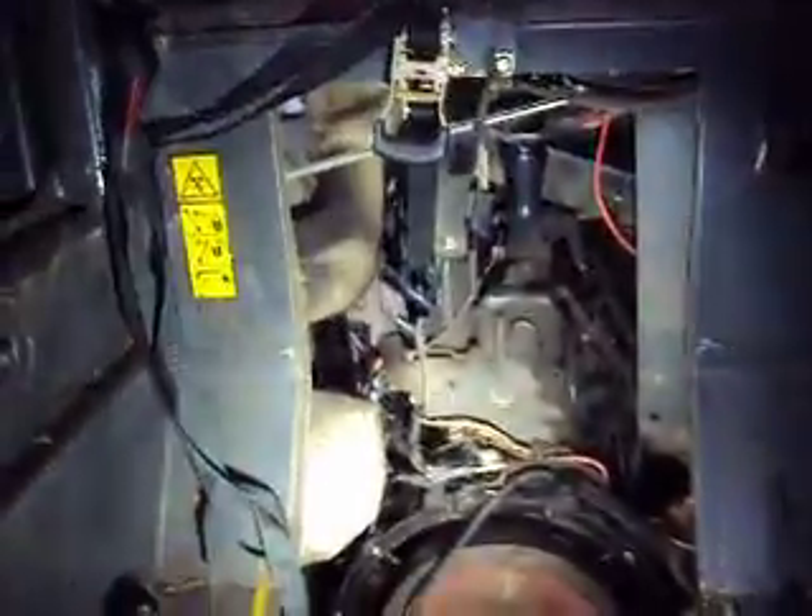To get this thing out of there is kind of a hassle. There are a lot of hydraulic lines you've got to disconnect. I had to lift the motor up - I put a bar across the top of the cab and then used a tie-down strap, cinched it up, and that picked the motor up about two inches off the bottom so that you could slide the pump assembly out of the mount down there.